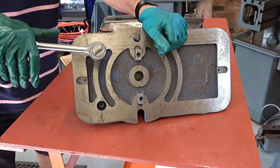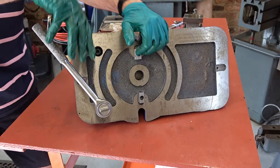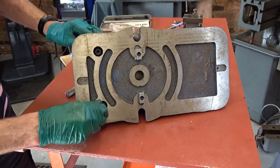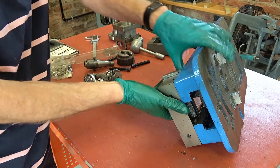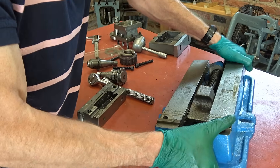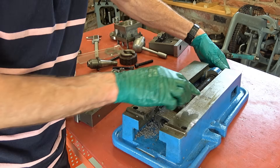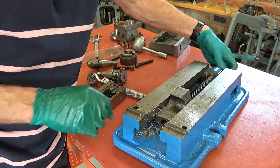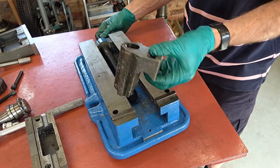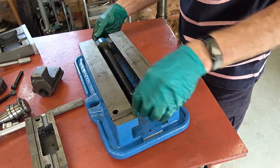This end jaw is going to have to come off to get the screw out. 8mm — 5/16 Allen key, cap heads. I've still got the T-slot pegs in at the bottom, that's why it's not sitting flat. It's a left hand screw. There's muck on here, but it might be mine. There's the nut — it's quite beefy. The thread looks quite reasonable in there, better than the thread on this screw.